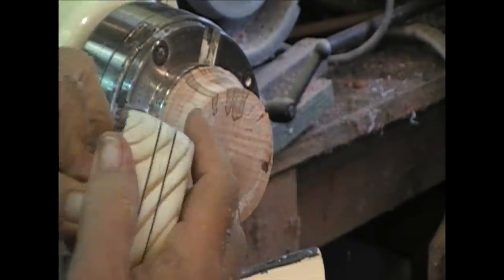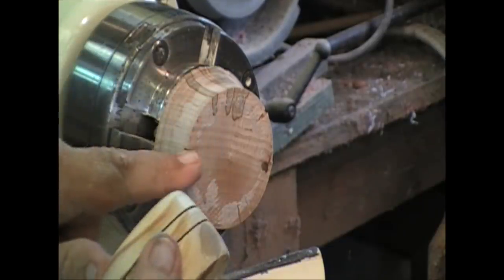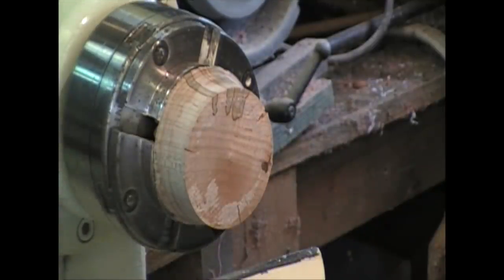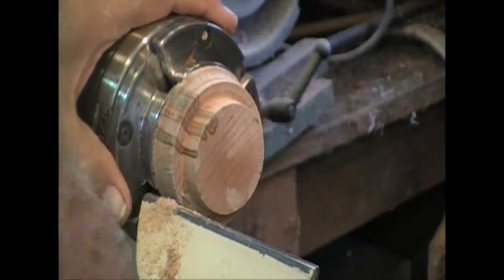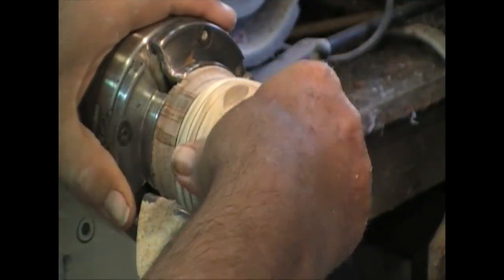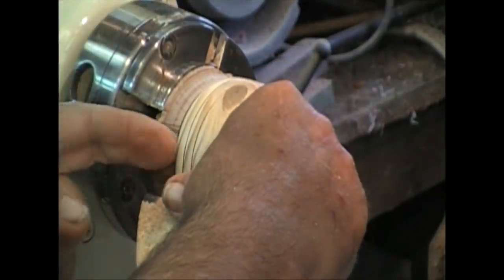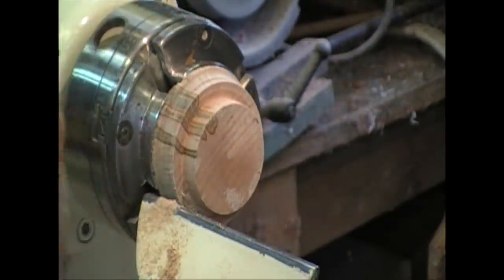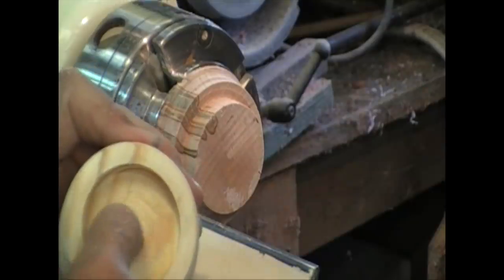Alright, there we go — I'm peeling it off. That is step one. Step two: I want to change my faceplate right here to match that tenon. Then we're going to glue it up again. Now, that was a beautiful piece of wood but it was a scrap block and I had to use it. I put that tenon on there — that tenon fits into the socket right nicely, just about snug. In a good day I'd probably try to turn it like this, but I'm going to put the double-stick tape right here. This shoulder back here — you can see the little crack? That's on purpose. This is deeper, this is longer than it is deep, because I want my bearing surface to be here on this surface, not on this surface. So let's tape up now.